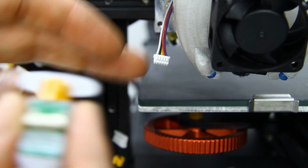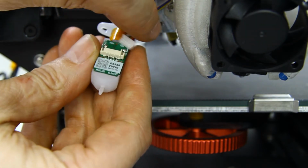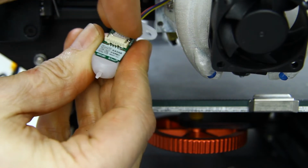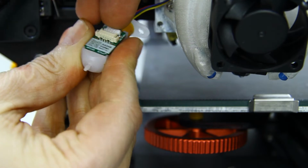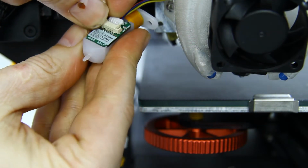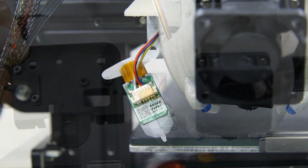Take the small 5-pin connector from the cable and line it up with the BLTouch, the crimp sides facing forward, and gently just slide it down, press on the sides. Try not to work on the cable, but the clip itself rather. In my case, white on the left.